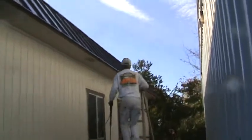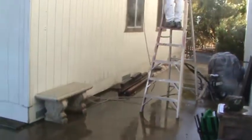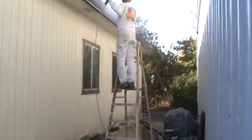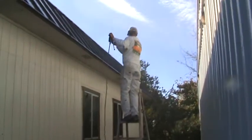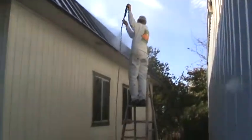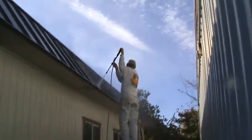One thing you'll find when you start running one of these is you're going to find other things that need to be done, too. See this whole sidewalk area? It's really dirty. With a power washer you could make it so clean. But if you use a really tight tip, you've got to do it nice and even — otherwise you'll see lines where the clean areas and not-clean areas differ. You've just got to play around with it.